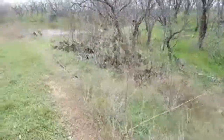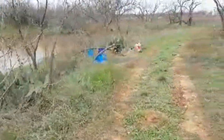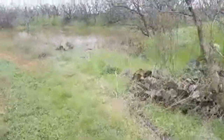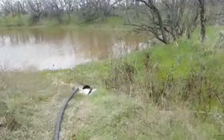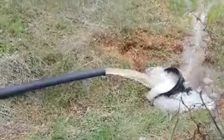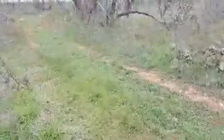I've learned something over the years about moving water with it. When I first bought the pump, I figured I'd just run it full speed — that would give me the most water. At full speed, its maximum from the factory spec is about 225 gallons a minute, and it will run for about two hours at maximum speed on a full tank of gas. But I figured out that if I reduce it down to about one-third speed, it still pumps about 180 gallons a minute.